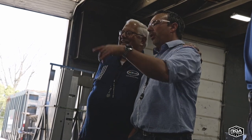So the joints with the rivets, we did steel rivets joined onto the aluminum. And when we say steel, they're galvanized. We ran those through a 1,000-hour saltwater test and saw basically nothing. We're very comfortable with the rivets and how they're doing it. That makes sense. Let's go to the front end and talk about the A-frame.